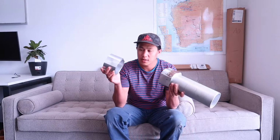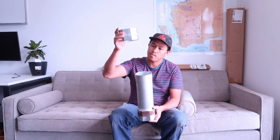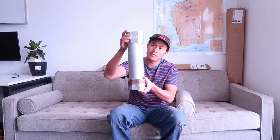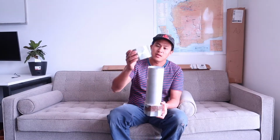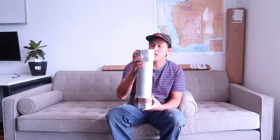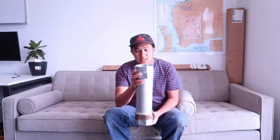Yesterday we did some work on this stuff. Today we're going to keep going on this stuff. We're going to machine back this profile on here, and that profile is going to allow this whole part to fit inside the boat. The boat has points that don't allow this to go in. We're going to grind this back. We're going to test fit it inside the boat. And what that means is if this sits on the top of the bearing, we know that this bit can go in down the bottom. They will match up, and that means that the part is pretty much ready to be cast into the boat. Cool, so let's get started.